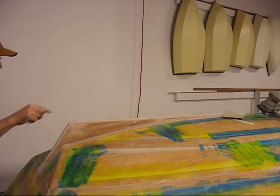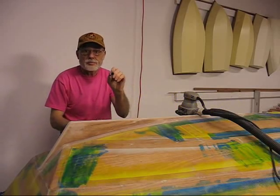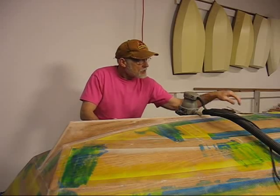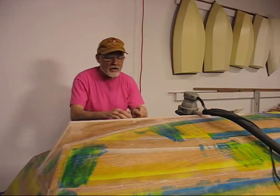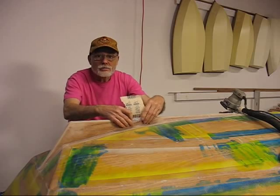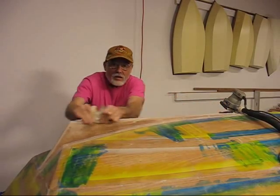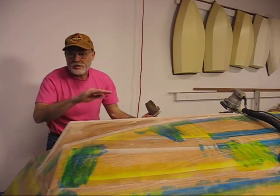I got some preliminary sanding done. I use a regular sander, but then I use various methods to shape it up. I take a piece of about three-quarter inch PVC pipe or ABS pipe, wrap sandpaper around it — that gives you a good radius matching the popsicle stick radius I was using. I've also been using the fresh edges of sandpaper from the machine. I'll take a piece of plastic tubing, cut it in half, and put the right side out onto the edge after I've shaped it a little bit with my low-angle plane. Then you can come along with that sandpaper and get a nice round edge for when I'm going to roll some fiberglass over this — a much nicer edge and a nice radius at the same time.